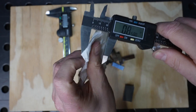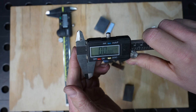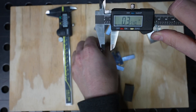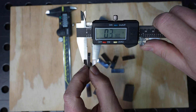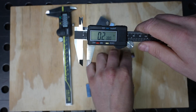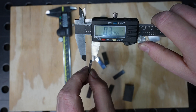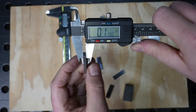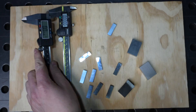Now doing the same exercise with the Nikos. When I tried to get a good zero it was bouncing between plus and minus five tenths — that probably has to do with the resolution and where the zero lands. First gauge block: I checked 139 thousandths and it's 138. Next: 109 and a half thousandths and it is 110. Now we've got 142 and a half thousandths — turn it around — 143 thousandths. We've got 199 and it's 200. And 145 — right on the money. 148 — again right on the money. I repeated this and it was within a thou on all of them — I'd call that a successful test.